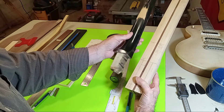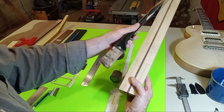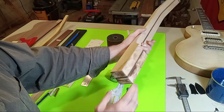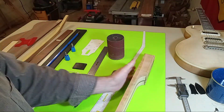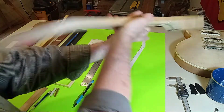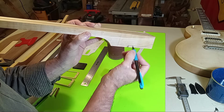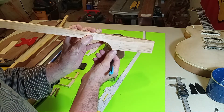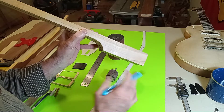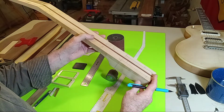You'll go from an S4S block heel very quickly to a shaped heel. You should also put this on the table saw up against the fence and cut the tenon depth. From our past videos, that tenon is one and a half inches tall right there, and this is probably about one and three-quarter inches from here to here. You'll be doing all this relief work and getting everything cleaned off so it fits to the body.